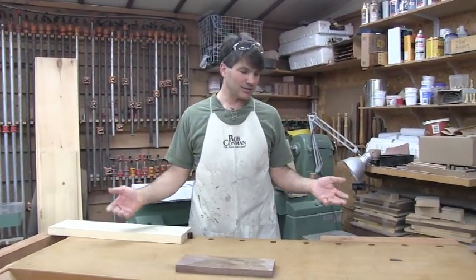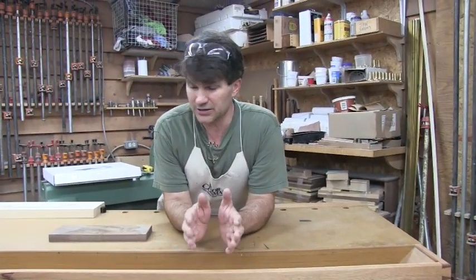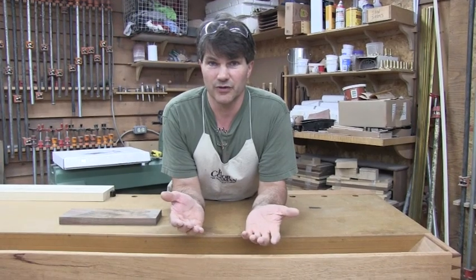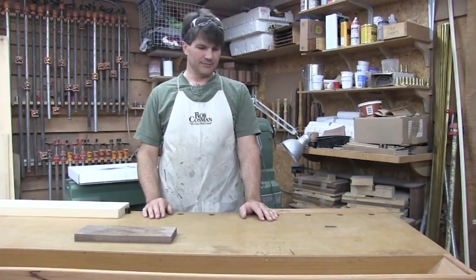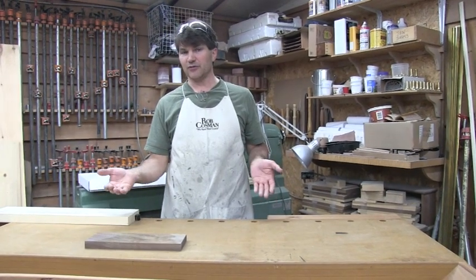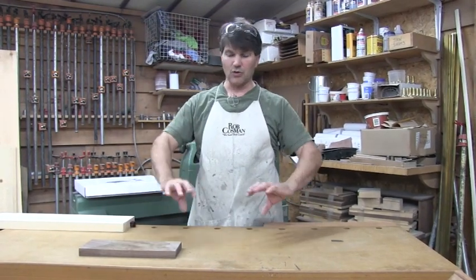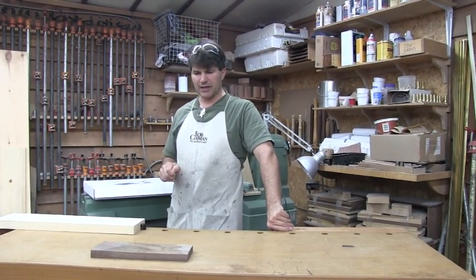For about a hundred dollars plus the cost of two vises and a little hardwood for the tail vise jaw, and with minimal tools, this could quite possibly be one of your best options to get started. You should never have to flatten it — that's the downside to a solid wood bench, which will move over time. If this one gets destroyed, just make another one: it's a little more than one sheet of MDF, which you can even buy in four-by-two foot sheets. It wouldn't cost a lot to completely replace it or flip it over if the top gets too beat up.